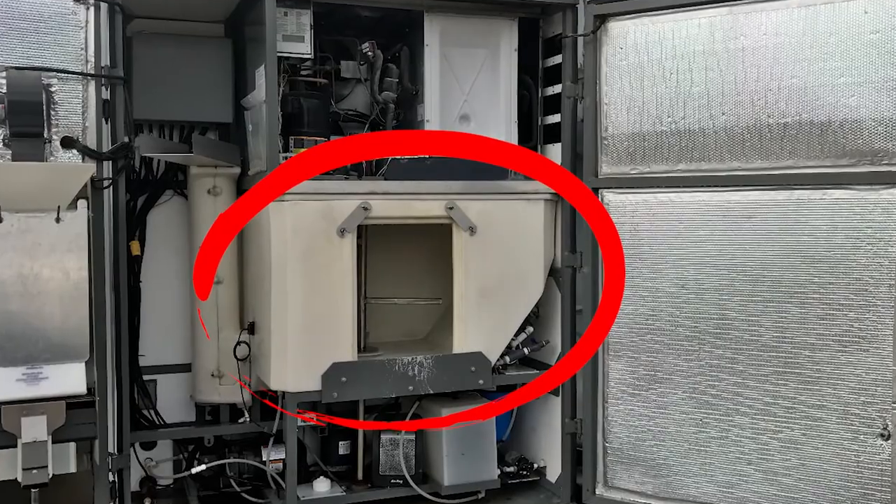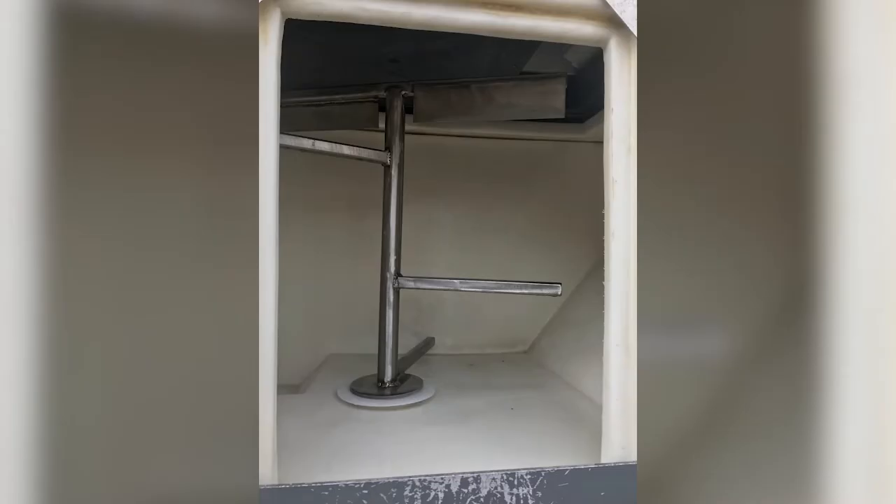The designs of these antiquated machines are far from efficient. For instance, in the competitors' machines, ice is kept in a rectangular bin. In the center of the bin is what's called a beater bar, and it rotates in a circle to agitate the ice to prevent it from solidifying and jamming up the machine. But only the ice within the bar's reach is agitated — everything else in the corners is left untouched, and the ice that is within reach of the beater bar is just pounded into dust.